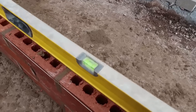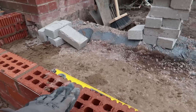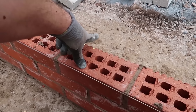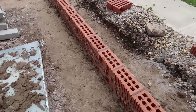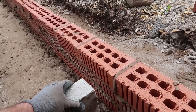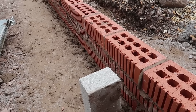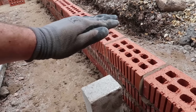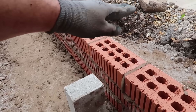We're looking good up to now. There's actually another two courses that go on this engineering brick, so it's five altogether, and there's three courses of commons inside. Then it's got to be the slab. Three courses of commons gets us up to there — not much room for a bed. Then the slab sits on there: a 150mm slab. And then that brings us up to DPC. That's why these have got two more courses before it's DPC.